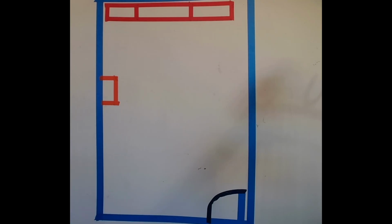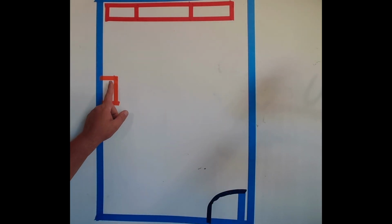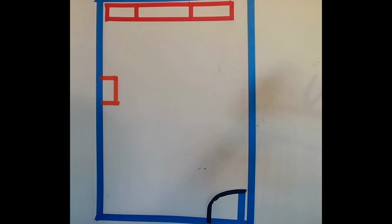Okay, so we're going to start talking about the design for the example that we have up on the wall here. What we have is an entrance. We have one HVAC that's just a CRAC unit. So we're just pulling air in from the top and throwing air out at the bottom, or air in from the bottom, throwing air out the top. We're just mechanically mixing basically the general area of the room.